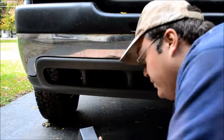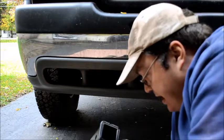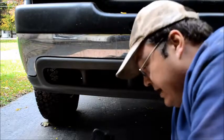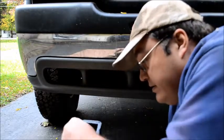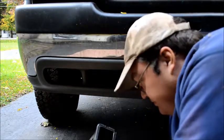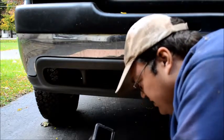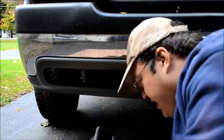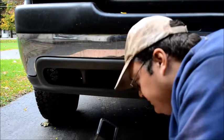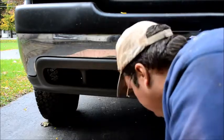When I get my real pieces I'm not going to use this one — oh my god, I should return this one. I bought this from Harbor Freight and the welding looks like I welded it — holy crap. Look at those little pins, that's a cold weld just laying on top. Looks like they had to restart the MIG welder six or seven times. There are little pieces of wire hanging in there — that's just stupid.